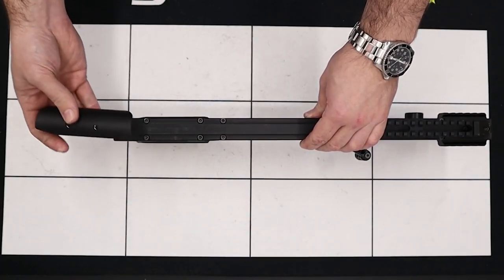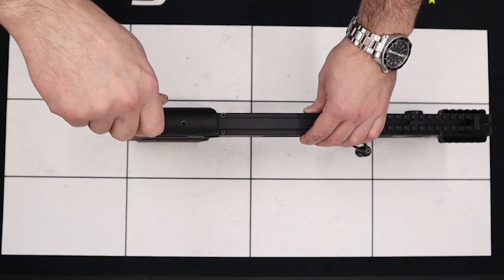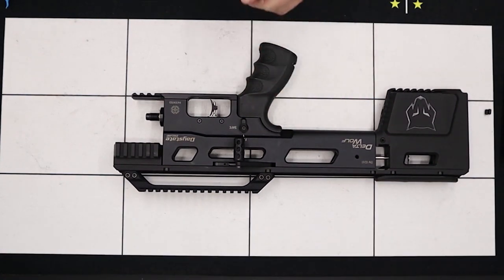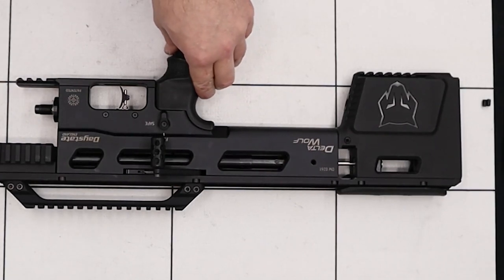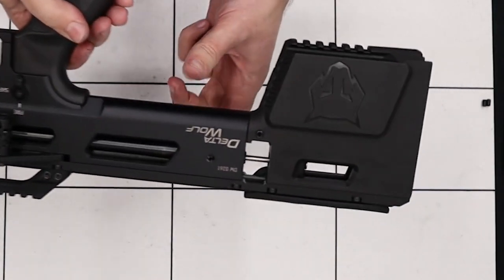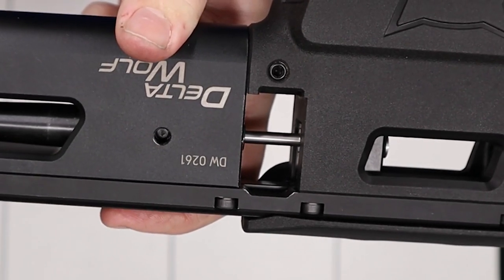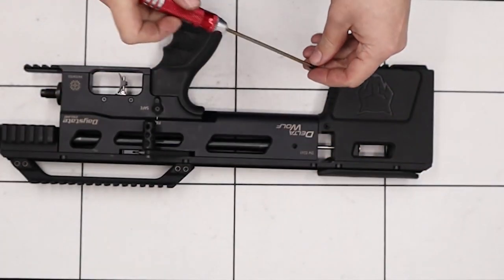With the wire tucked away nicely, we can now add our cap back using a 3mm Allen key. The cheek piece can be fitted on the right or the left hand side depending on the shooter's preference, then secure the two screws on the top using a 2.5mm Allen key. With that done, we can bring back the block of the rifle and install the barrel — push it all the way home. Looking through the side of the block, we can see whether the barrel is lined up correctly.